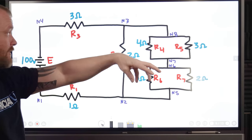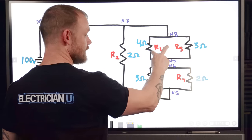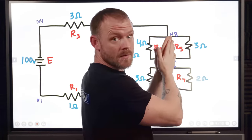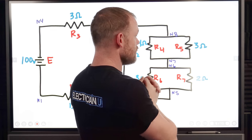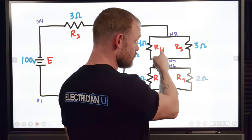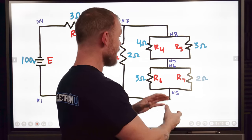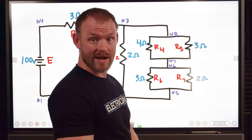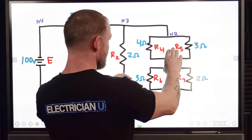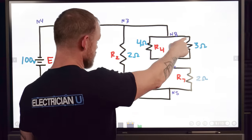We've got seven resistors here: R1, R2, R3, R4, R5, R6, and R7. I'm going to start combining these things because if I can figure out what the total resistance is, I can turn it into one number. R4 and R5 — combine those into one resistance. Same thing with R6 and R7 — combine those into one resistance. Then those two are in series with each other so we can add them together, getting one total resistance for this whole branch. Then we have two branches in parallel that we smash together into one total number for this whole side.